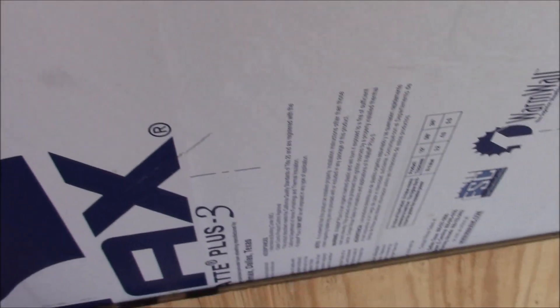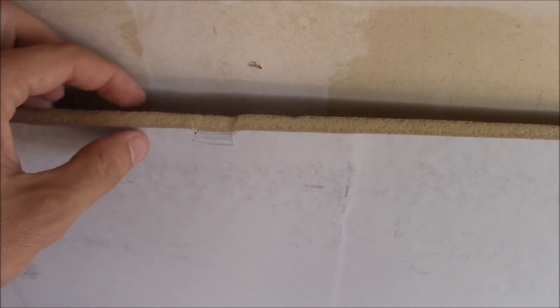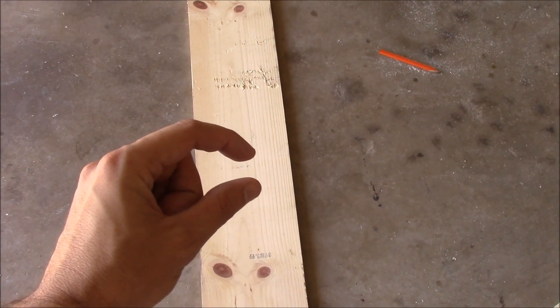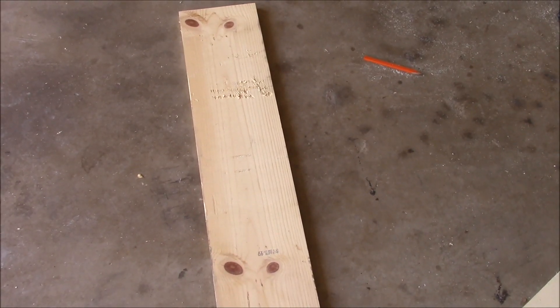I'm going to be lining the inside with foam board — the kind usually used on the outside of houses between the brick and the frame. It's half-inch thick, not the greatest insulation ever, but for a basic mini refrigerator it should be decent. The wood will be on the outside, so I need to allow for that half-inch of foam on the inside. Accounting for that, plus a half-inch shelf, the side pieces will be 20.5 inches tall. I'll go ahead and cut two side pieces from this lumber.